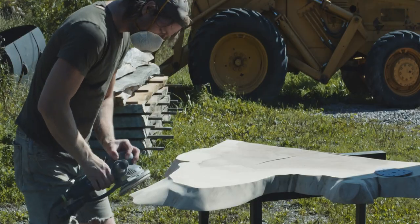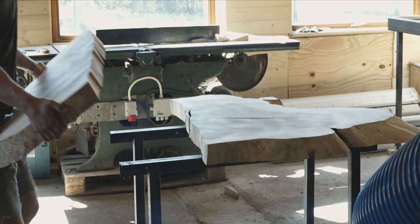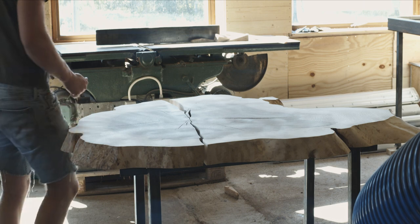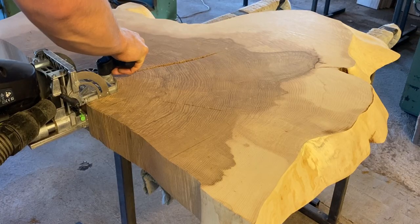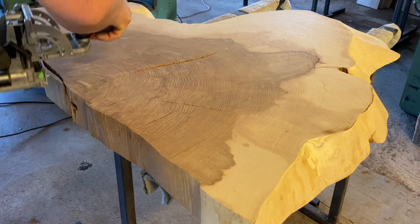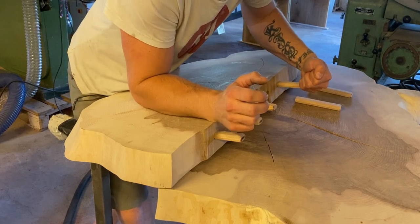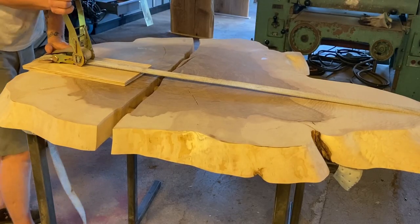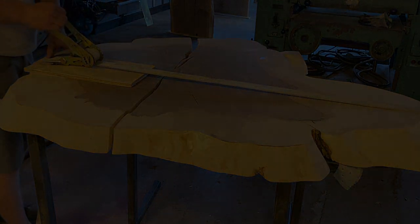A bit more rough sanding and shaping and we are ready to join the pieces together. I decided on using dominoes as floating tenons, which are glued, and then the idea was to put bow ties on top of the dominoes to make them a little less visible and also add a nice decorative touch. If it makes sense and they serve a purpose, they should be used — and they are actually surprisingly strong too. This will hold all the pieces in check and make the entire tabletop somewhat solid. Thanks to these dominoes, both tabletops are now a single piece.